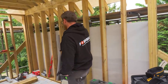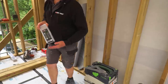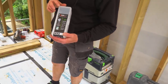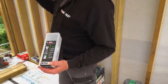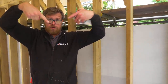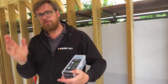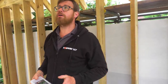I'll show you what we used actually. We used these timber screws - these are the 100mm ones. So we've got three in the end of each rafter into each ceiling joist. Then at the top they've been driven down one on each rafter, then spike nailed at the bottom to stop any movement there. It's just been timber screwed all the way around and it is absolutely rock solid - that's never going to spread.